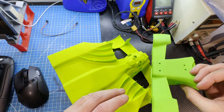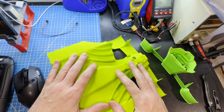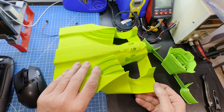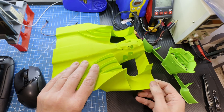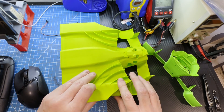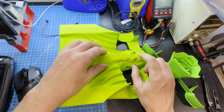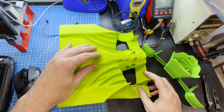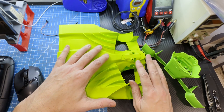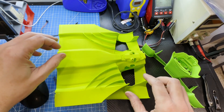If there are any filament makers out there looking to sponsor a crazy project, let me know. Printing thin walls with lightweight PLA also had difficulties because it's quite flexible — it's more than strong enough for the overall monocoque shell, but it really needs additional strength in higher stress areas like around fasteners. I would need to design additional geometry around those areas to force the slicer to print them solid, or optionally use a dual-extruder printer to combine lightweight PLA for the overall shell structure with PLA+ in the high stress areas.